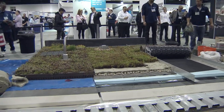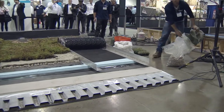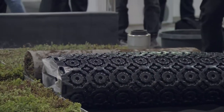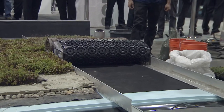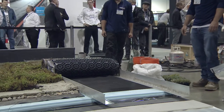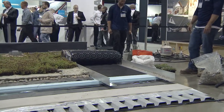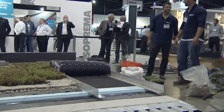Now handing over to Jelle for a built-up roof on an inverted roofing system. Built-in-place vegetated roof systems are the classical and most common vegetated roof system on the market, with a history of over 40 years worldwide. Built-in-place means the vegetated roof is assembled on site layer by layer. Their unique compact, layered design creates clear separation between membrane protection, drainage function, and growing function — engineered to give vegetation optimal growing conditions without relying heavily on irrigation and fertilizing.